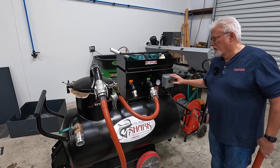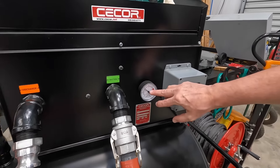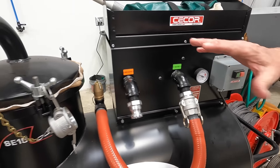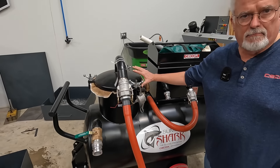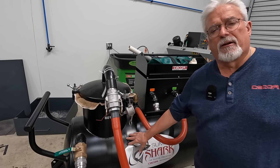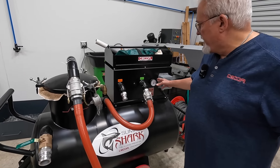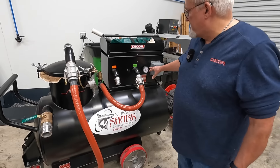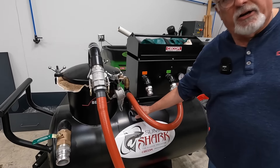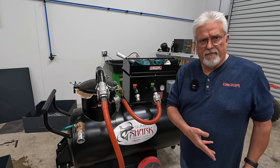When you're cleaning the sump, the unit will be running and all of a sudden you'll be showing full vacuum on the gauge but have no suction at the end of the hose. That means the filter is probably now full of solids, or the hose has a blockage. But if you're running and cleaning and you have no suction at the end of the hose but the gauge is still showing zero, that means the fluid has completely filled the tank. There's a flow control inside that shuts the vacuum off to keep it from overflowing.